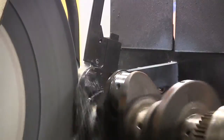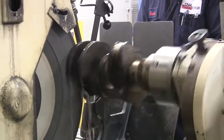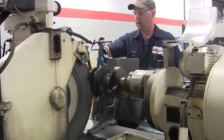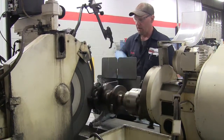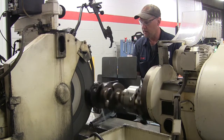Cleaning up the radius and sidewalls is very crucial in the crankshaft grinding process. The reason being, if you don't get them cleaned up, it will leave a fracture or stress point causing the crankshaft to break in the field. Once I get down about half or three quarters of the way, I'm going to traverse over in each direction and clean up my radiuses and my sidewalls.